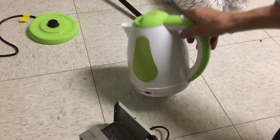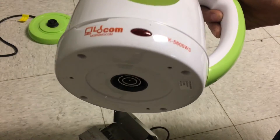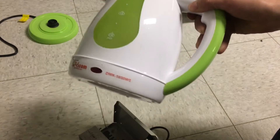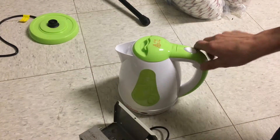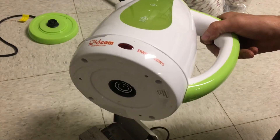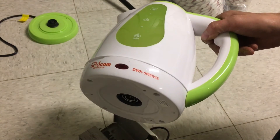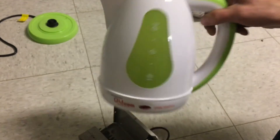Now the question remains — I don't have any more 220 volt inverters. So if I run this heater on 110, it's still going to pull 1,500 watts, which is about 12.5 amps. That would be fine, except the wires inside are small because they're designed to push 220 volts at only 6.5 to 6.8 amps. If I do that at 110, I double the amperage to keep the same wattage because I've halved the voltage. So does that mean this thing will burn up? I don't know, but I'm not willing to find out tonight.